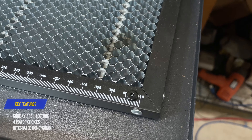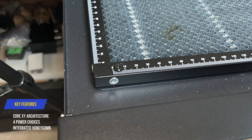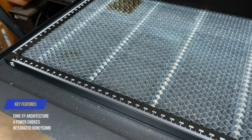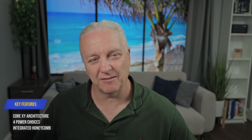The third feature might seem a bit trivial but it's actually really significant — and I haven't seen this on other lasers — and that's the honeycomb built into the tray. If you slide the tray out, the crumb tray, the honeycomb comes with it. Unlike most lasers where you plunk the honeycomb underneath and it's free to slide around, here in the P3 it's bolted to the bottom tray, which has very accurate repositioning. The honeycomb is always in the same place and doesn't move around, meaning you can accurately position material on the workspace. For the price of four screws, you get an exceptional capability.